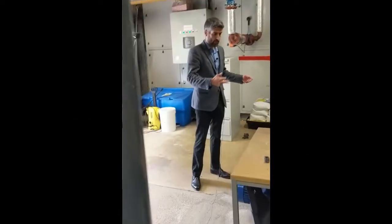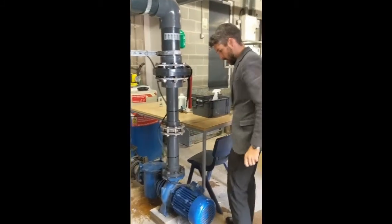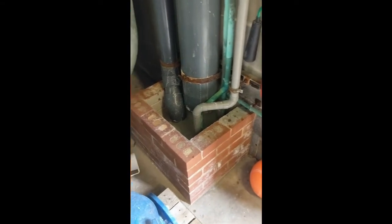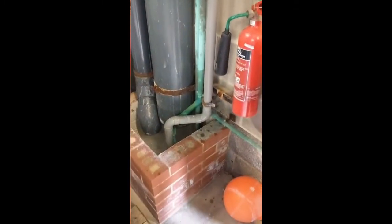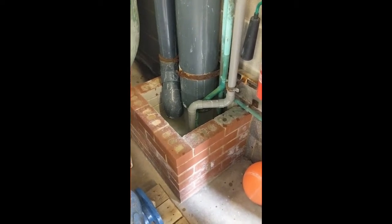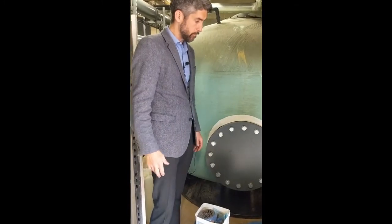This system requires both pumps running to get the flow rate, but two pumps aren't required to do a backwash — one pump will be sufficient. And there we can see the backwash running. If there was a clear piece of pipework you'd get a better idea of the colour of the water, because initially the colour in the sight glass would go completely opaque and cloudy, then gradually get clearer and clearer as you successfully clear more pollution out of the filter. It gets to a point where it's as clear as it's going to get, and then you've completed the backwash. It depends how polluted the water is and how long since the last backwash, but four or five minutes is usually about right.